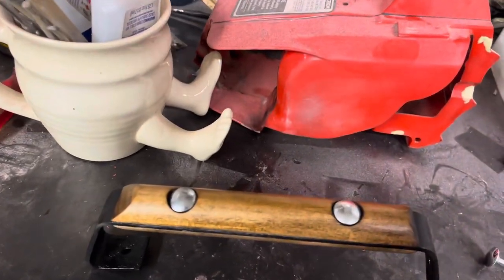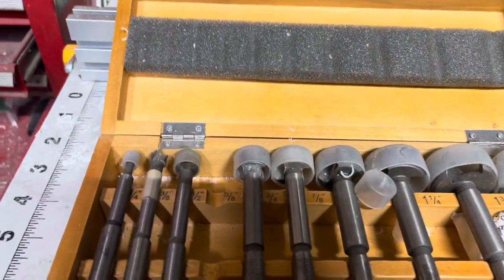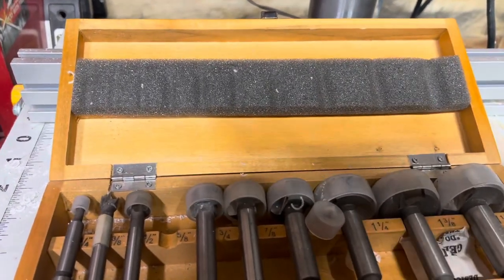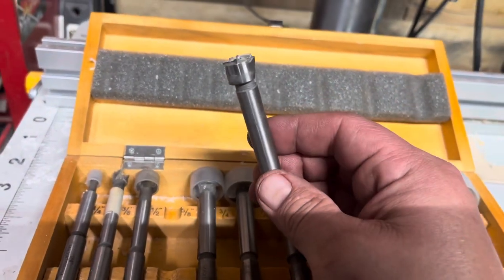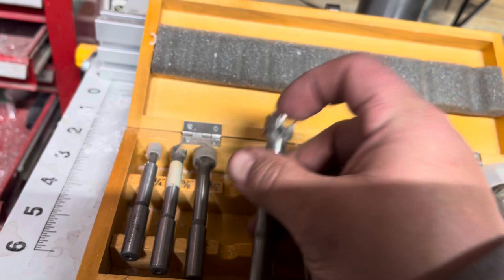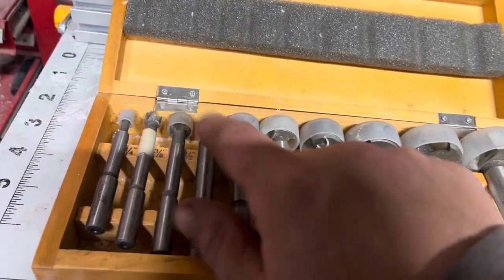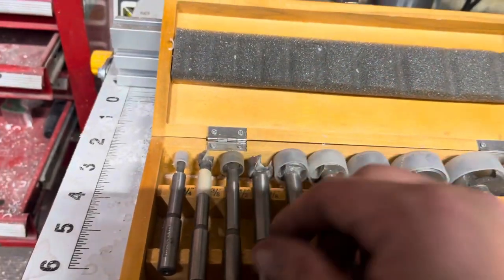Let me show you what I use to get the holes set for the carriage bolts. I always do a pilot hole first with a drill press — it's a lot easier than by hand. Do a smaller pilot hole first, then step up to the bigger bit. This set of drill bits is great because a 5/8 bit drills so nicely — it is the exact size and circumference of that metric carriage bolt head. I've found that certain metric-style bolt heads fit American-style drill bits and vice versa. The 5/8 fits and slides in perfectly.